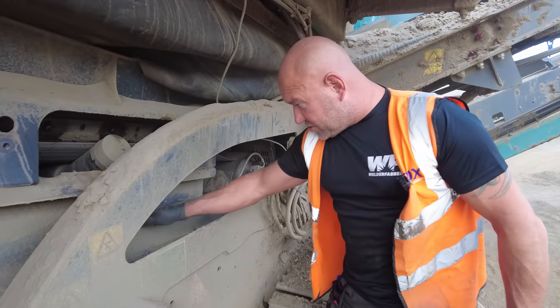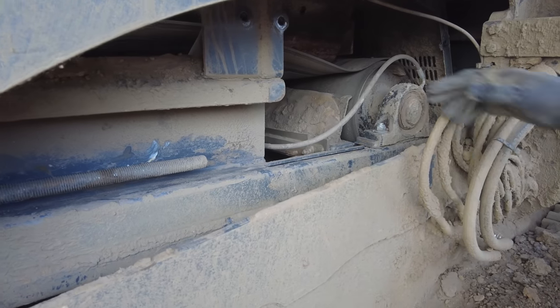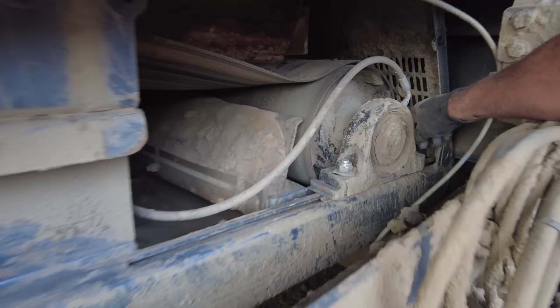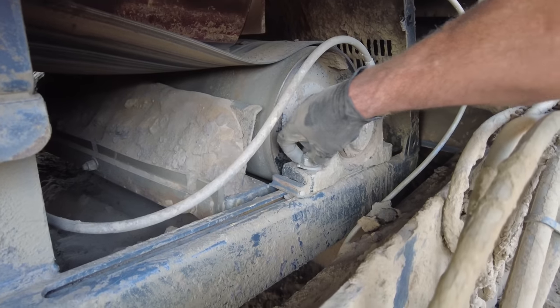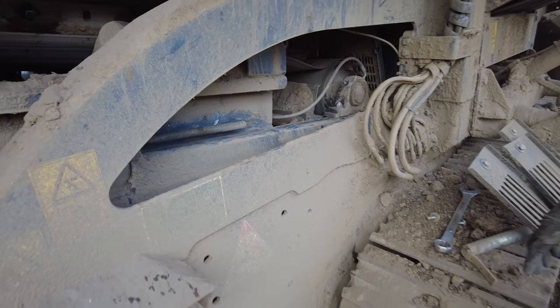Right, so this is the adjuster bolt for releasing the tension, yeah. So I'm just cleaning it out. We'll just nip these 24s down a little bit, so they're 16 milli bolts. Just slack them off a touch, and then that tail drum will come back.